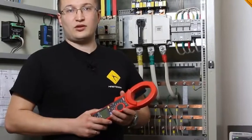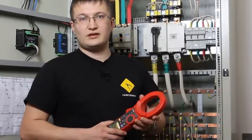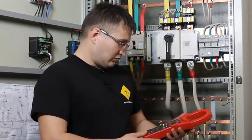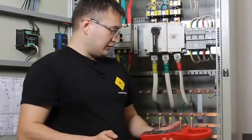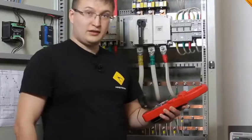Now we want to demonstrate the possibilities of the analog output. It may help to better analyze the line current waveform. At most loads provided by electronics having switch-mode power supply units, the current will be far from a sine form. Let's check this. Open the output connector. I have already connected the probe to the oscilloscope. Now I connect it to the meter and start measuring.